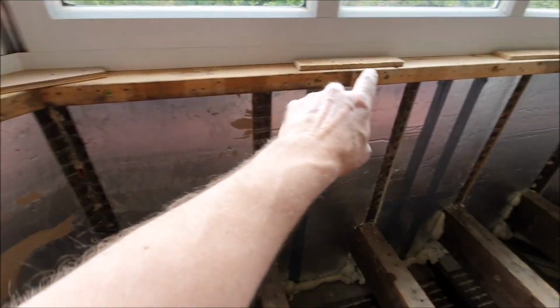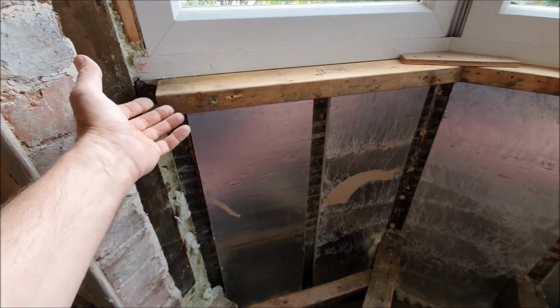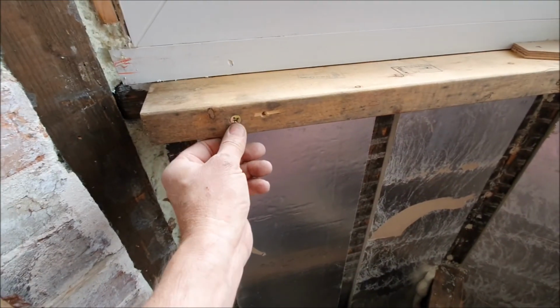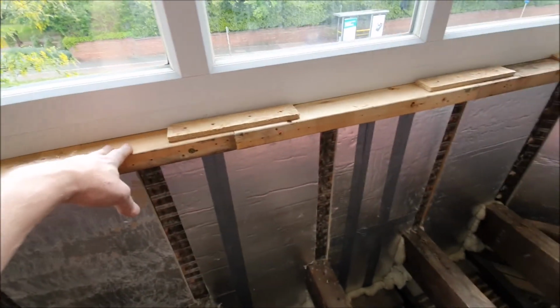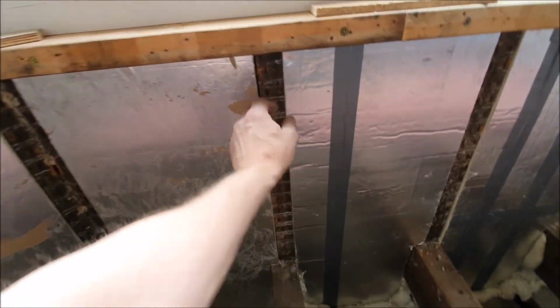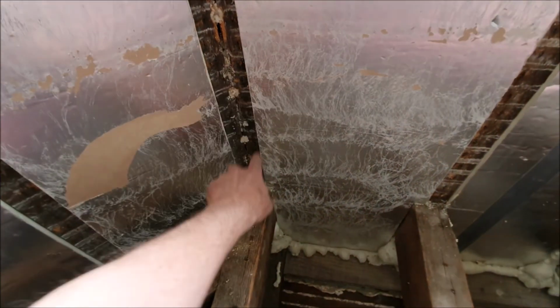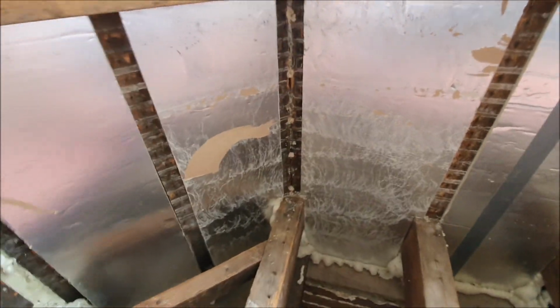depending on the thickness. This undersill or support sill is off again. I've glued all that up, I've sealed it all underneath the frame, and I've screwed it with some great big screws through, and it's all fastened, so you can pretty much stand on that, it's that strong. The next thing I've got to do is to lap these out and bring these out after I've filled the little gaps in here, and then mark where they are, so that in future when I put some plywood on, I'll know where these are.